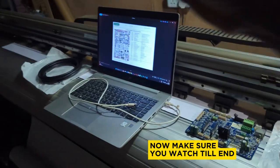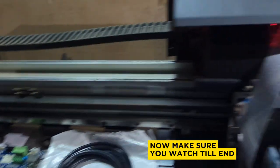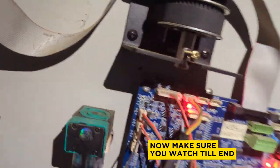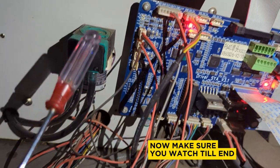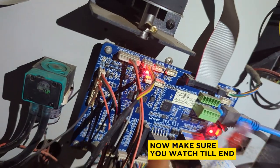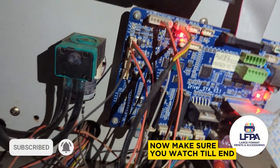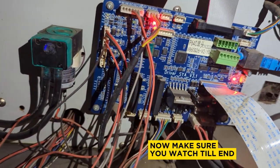The carriage board, which is on top, is the one responsible for the movement of your machine side to side, and beyond that is the board that really controls the printing of your machine. But the driver board is the board that basically makes sure every other thing in your machine functions. For instance, it's the board that controls the pump, the fan, the motor, the network cable that I mentioned in the previous video. It controls the power of your machine — your 24 volts and your 42 volt board are essentially connected to this place.